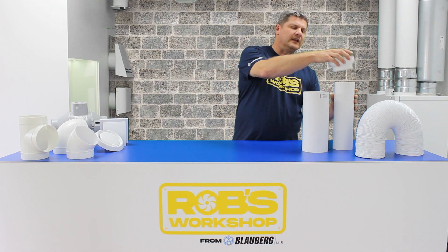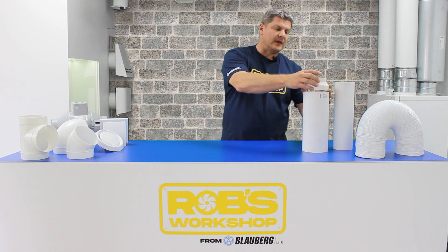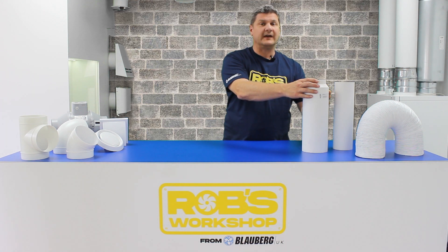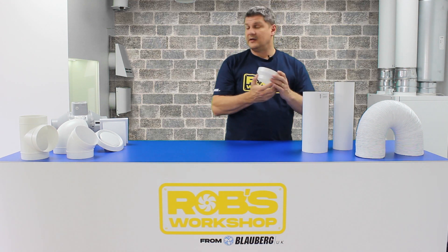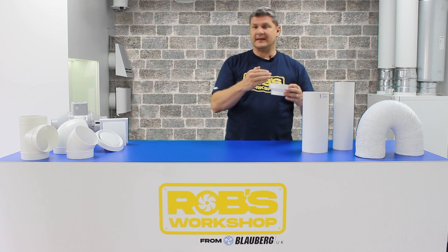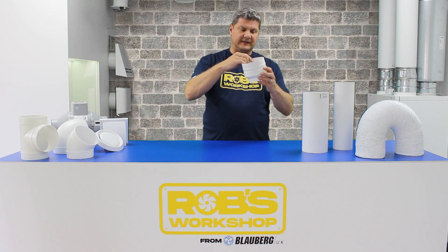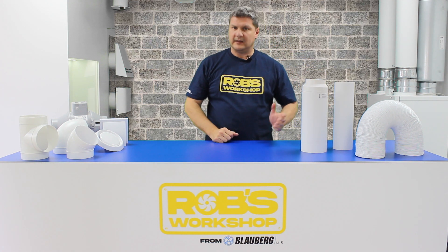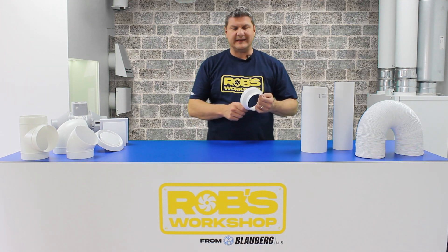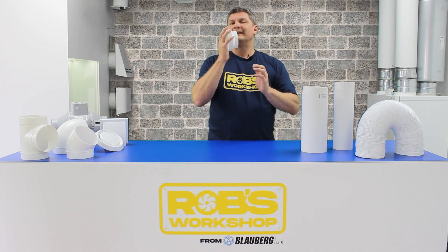The confusion comes when people try to fit the large end, which is 125mm, to a piece of 125mm ductwork. The confusion is that the large end of a reducer is in fact female also. If you look at this logically, the way out of this is: female and female — take a male fitting and fit the two together. So you would take a male coupler, the joining piece, and that will fit inside the female end of the reducer, and then you locate that into the pipework. So the exception to bear in mind is plastic reducers: small end is male, large end is female.